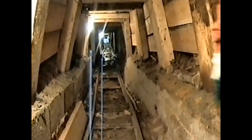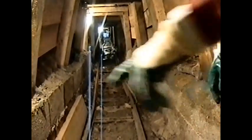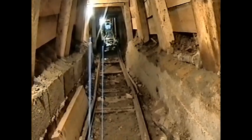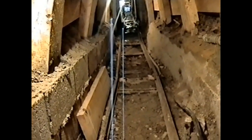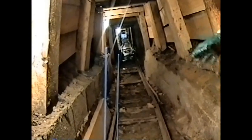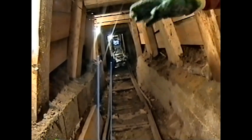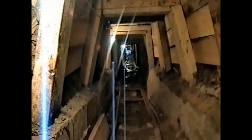This section had lintels in here — no concrete, stone ones. So this is concrete blocks. I would think this has been repaired in the last 10-20 years. You can see the concrete lintel across there. I think this section was repaired in open cuts. This was very difficult to get through because of the large boulders, and that's what we timbered up. We thought when we found it, we decided to go the other end to come this way, to leave the lintels and structure in and just take the pipe out, but it didn't work out quite that way. So we came back in and headed through it to the next manhole.